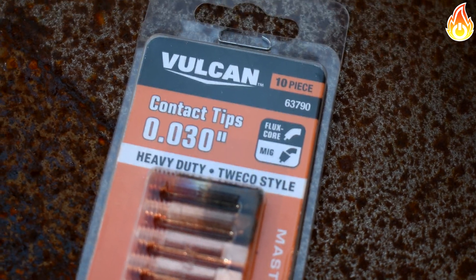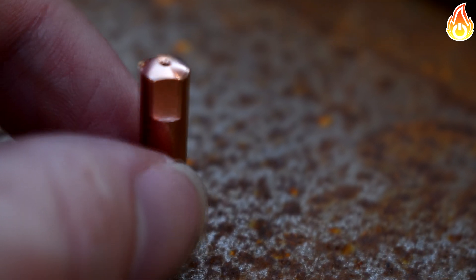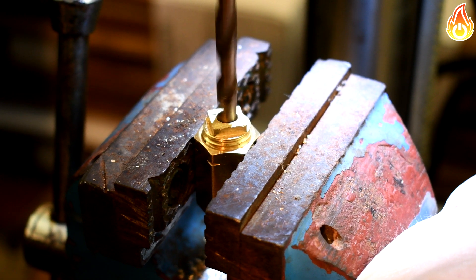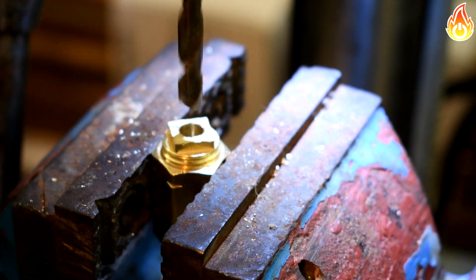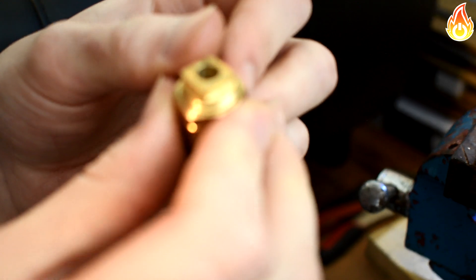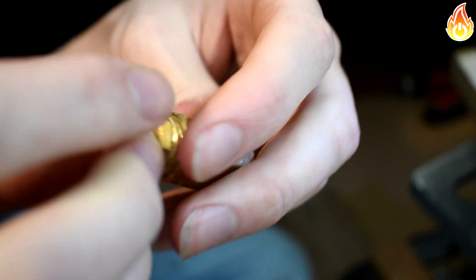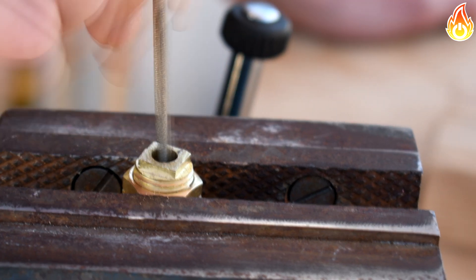To fix the nozzle, I decided to use contact tips — 0.03 inch welding contact tips. These are just about the same size as the drill bit we originally wanted to use, but should be easier to install because we can use a bigger drill bit to drill a hole and insert the contact tip into the nozzle. I went and drilled a hole just about the same size as the end of our MIG tip into our brass plug, then filed the hole just a tad bit bigger to make sure we had a nice snug fit.